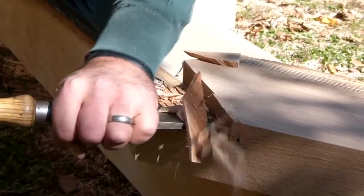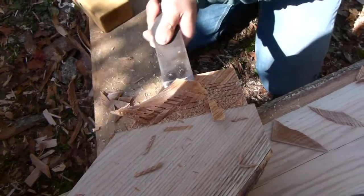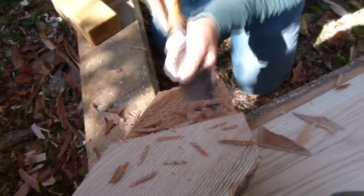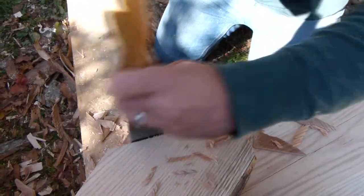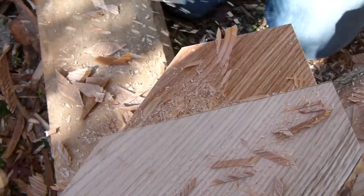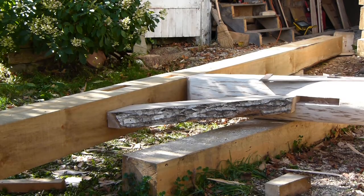This is just tuning up the shoulder. This is Matt. As he said, this isn't the first one that he's done — he and his father used to have a company building timber frame houses when he was younger. And it's very clear. He wields a chisel with ease, and it's pretty fun to watch him work. Really confident, really smooth, and he really just understands wood, as he's demonstrating with this oak heartwood right here, just slicing it away, bringing it down to the shoulder and to the level it needs to be.